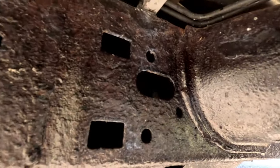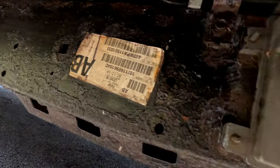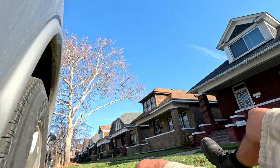Look how it looks — beautiful, already ready to be painted right here. But look, this is what happens when you don't do proper prep — it wasn't sandblasted or anything, and a piece chipped off. So do I expect more to chip off? Yes, but it's going to be less for me to maintain down the road, the more I take care of it. So I'm going to put a coat of primer on right now.